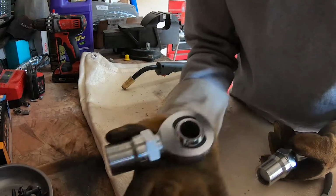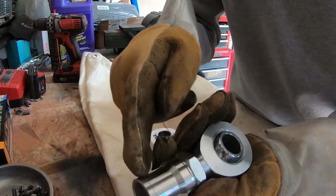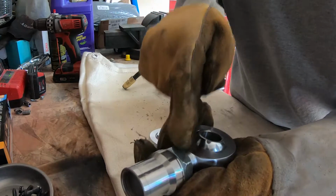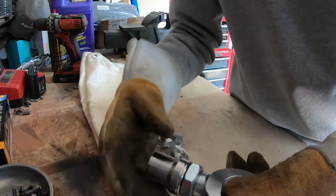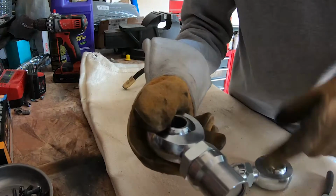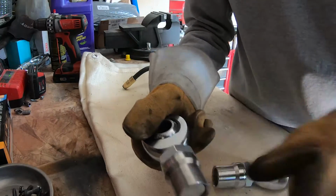I'm using a right hand and a left hand in each arm. The left's got the line here on the adapter, and it's got lines on the jam nut, so you know that's a left-hand thread. See? The right doesn't have that. Jam nut's there. It's got no notches on it, and it's got no line there.